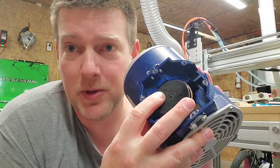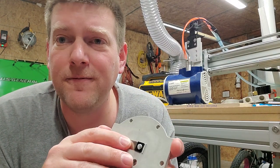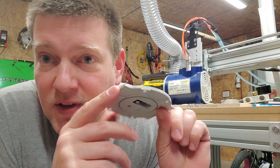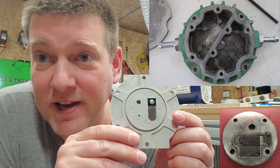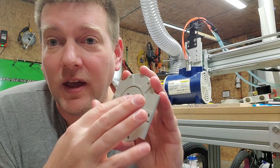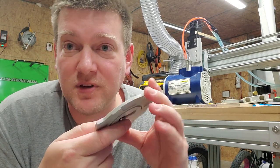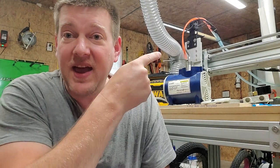There are almost no parts to replace. When you do a PM on one of these, you're going to check it for vacuum by completely occluding the device and checking the vacuum. If you aren't able to pull 20 to 25 inches of mercury, you pull it apart and take a look at these little flapper or reed valves — they get dirty. Just take it off. You can find these reed valves on the open market. There's also an O-ring that sits in a groove here. If your O-rings are good and your flapper valves are cleaned, the pump should generate a pretty reasonable vacuum. That is a wobble piston pump.